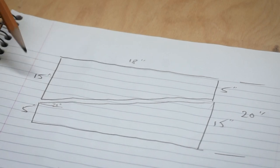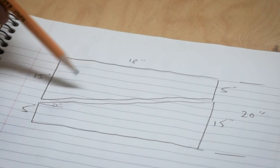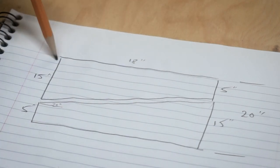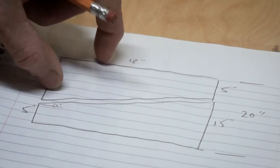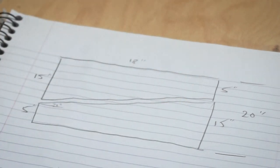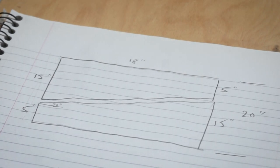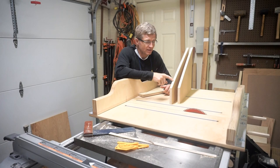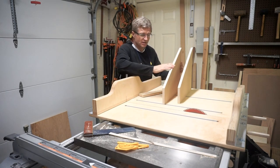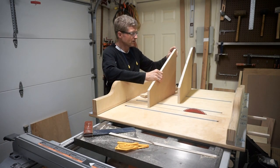For the sides, I need to cut two pieces. To conserve material, I'm going to cut it out first as one piece — I've laid out the two pieces: 18 inches across, 15 inches high for the first piece, then flip it over for the other piece. I've got another 5 inches for this end — actually 4.61 inches, but I'll cut it 5 — and the same thing over here. So the overall dimension will be 20 inches in this direction, 18 inches across. By accident, I had the camera turned off while I cut the mitered sides of the side pieces, but those are cut to a nice 60-degree angle — 4.61 inches on this end and 15 inches on this end.